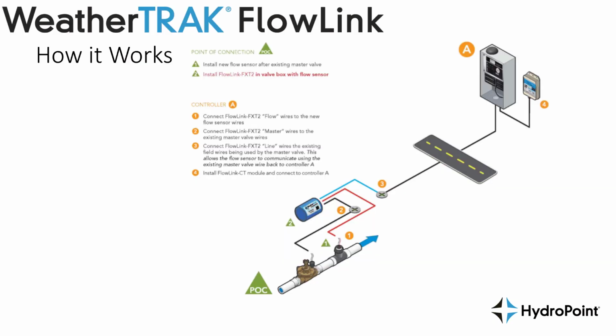Again, if you look in the Flow Solutions Guide, you'll see a great wiring diagram that highlights that the CT or controller transceiver is installed at the controller. Then we have our wires that run under the asphalt or other obstructions out to the field. And in this case, they run right to the point of connection where the old master valve sat. In this scenario, we can just disconnect the two wires from that master valve and use them to install the FXT and wire up both the master valve and the flow sensor.